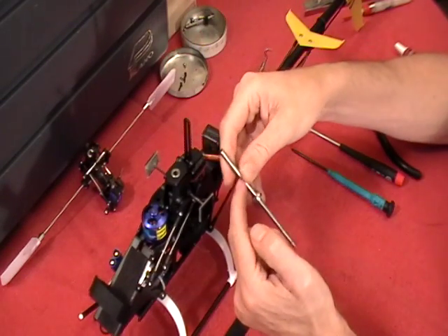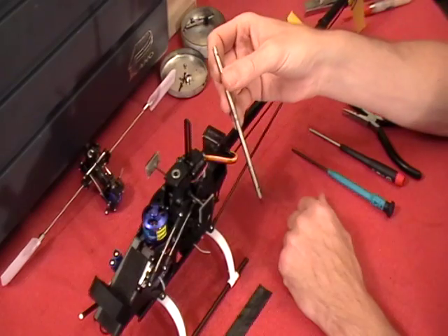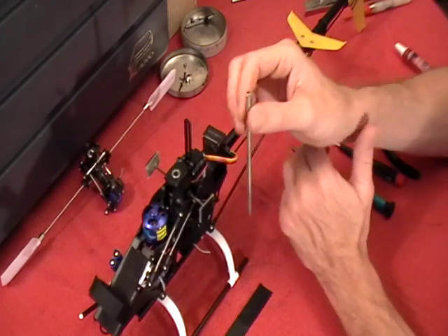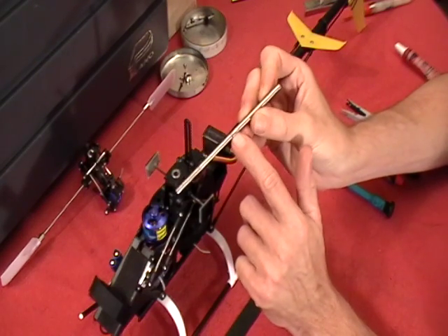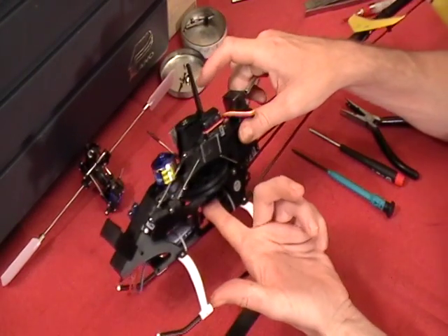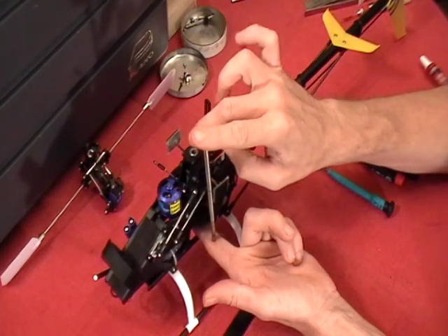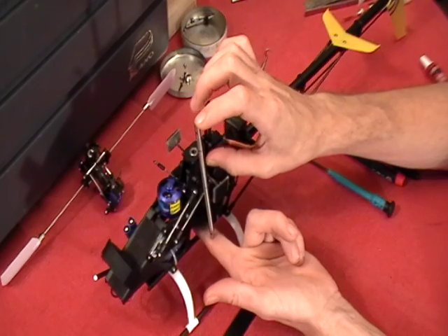We've got our shaft out. We're going to replace it with our new shaft — nothing wrong with my shaft so it's going back in. Should you have gotten mixed up on orientation: the little notch is not halfway down the shaft, it's about two-thirds of the way. If you hold your finger at the bottom of this plate where your bottom bearing is, and put the shaft there, you can see where the notch is in relation to the top of the main chassis. That notch is there for the collar to go around, so obviously that's the way it goes — if I flip it the other way, the notch is well below the bearing location. So we know which direction it needs to go.